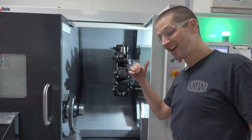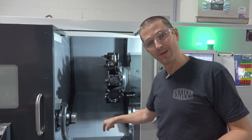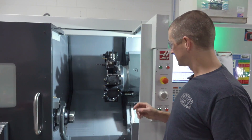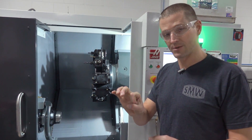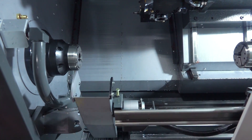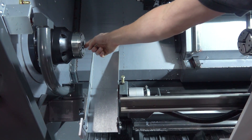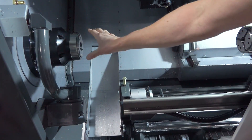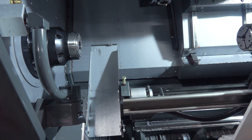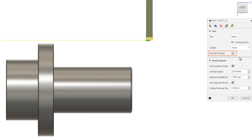Two of the most important things we skipped are the tool arm probe and the parts catcher. The parts catcher is super cool. If you're looking for a solution that lets you spit out finished parts, I don't want them in the bottom of the machine — I want them handed off to me. The Haas parts catcher has worked out pretty well so far. We've used it for some 2.5-inch diameter, relatively heavy parts, and for some pretty small quarter- or penny-sized parts. There are a couple of adjustment screws: one adjusts how close the parts catcher comes to the diameter of your part, and another adjusts where the parts catcher comes out — whether it's touching your main spindle or your sub-spindle. There's a little bit of manual setup when switching between parts.